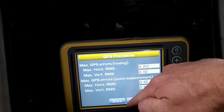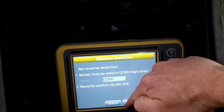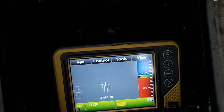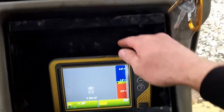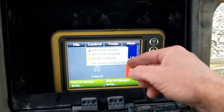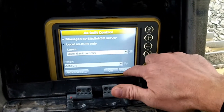All right, we'll check the measurements after I get it live. Bam — instant green! That's all it was. These guys did an outstanding job. The machine control troubleshooter says: outstanding job. This company installed their own system on their own machine, took all the effort — and it works. The only things they had wrong were an ID number for the sensor and no terminator on the sensor. That is outstanding.